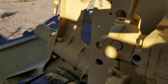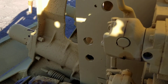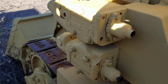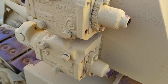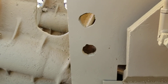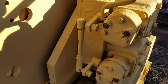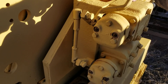This one has a joystick. The way that works is it's connected via a push rod to both these valves, and those valves each control one of the drive motors. So you see — bring it forward, this one's a little finicky — bring it forward, it brings them both down. Bring it back, it brings them both up.